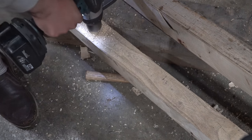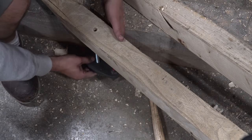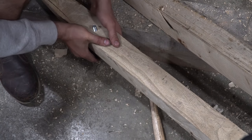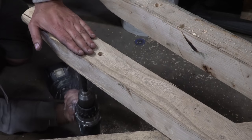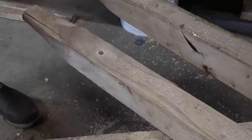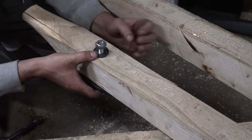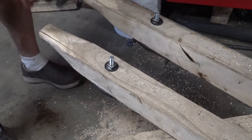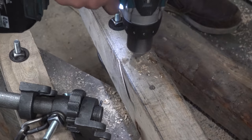With that assembled we're back to finishing the frame. I'm trying to attach the spikes near the front of the frame of the saw that latch on to the log, dig in, and help stabilize the entire tool. I used some red paint to mark the spots where the little feet go so the spikes can't twist in position, then I'm locking it down with brand new square nuts — because the original ones had to be chopped off with the angle grinder. No more carriage bolts for that specific application because they're the work of the devil.